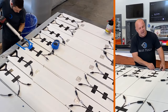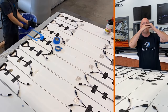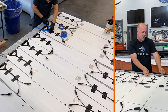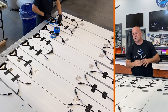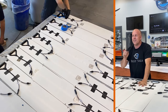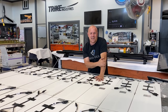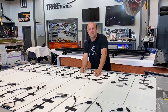And then that entire section where that joint was done is sliding into a tongue and groove, two pieces of aluminum on the skin. So there's no way that even though it's a bonded in seamed joint, that joint is between aluminum. So should be in good shape. Time to glue it up. It's been a lot of work. If I didn't have Dylan right there working, my son helping, he kind of took over this project. We did a couple together. He did the rest, so it's awesome having my son here with me. Let's get back to work.